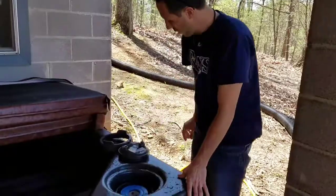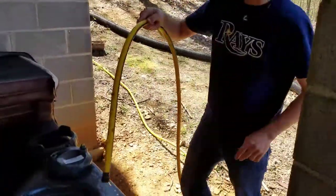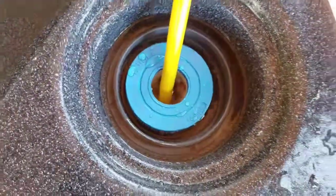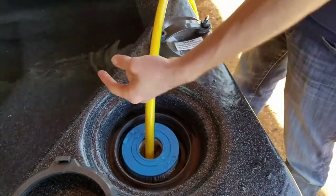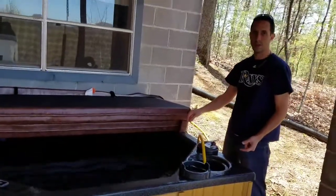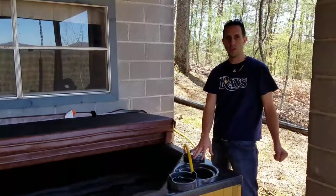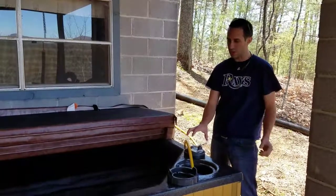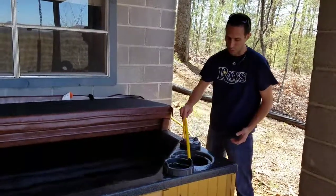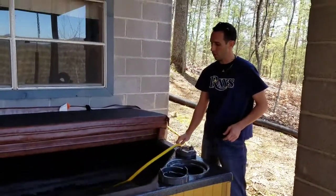When the tub is completely empty, you can start by putting the hose right down in the middle of that filter housing and start filling the tub. What will happen is you'll start seeing water shooting out of the jets when it's empty — that's just the hose making its way through all the system as it fills up. What I noticed is when I filled it up that way, it did fine at first, but then the hose pressure was so fast that it couldn't get the water out of the jets fast enough, so it started overflowing. Not a big deal — I just pulled the hose out, the water level reset, and then I put the hose back into the tub to finish filling the rest of the way.